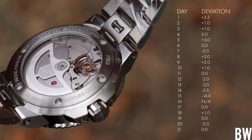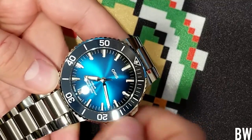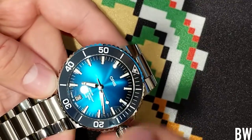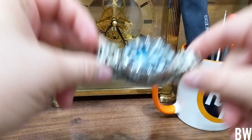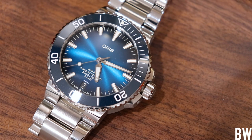You'll notice that a little further down the days of testing, the watch started to get slow. Those were the days it was being tested for power reserve — sitting on my desk. I wound the movement and did a time-lapse of myself winding the crown, because for this caliber you have to wind it 210 full revolutions of the crown to get a full wind of 120 hours of power reserve. I went a little overboard and did over 300 just to be safe. Then I set it down on the desk right in front of my gold-plated Seiko quartz desk clock, got some time-lapse shots, and it just sat dial-up while I tested the power reserve.